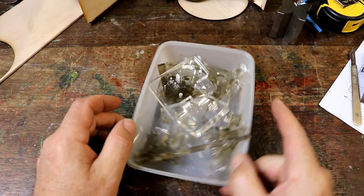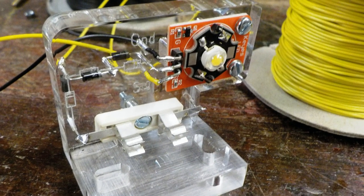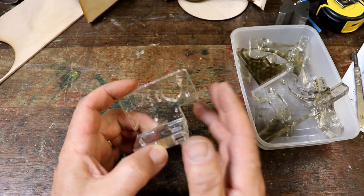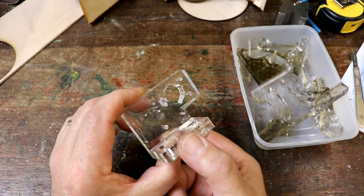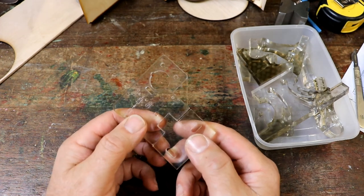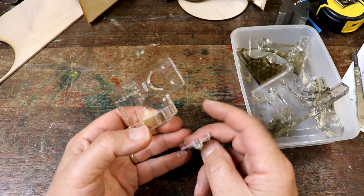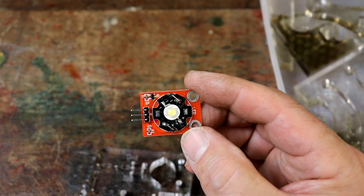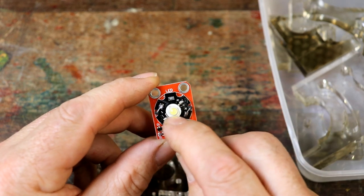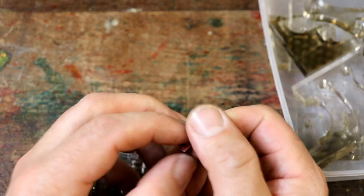Here are all the 10mm parts — all sorts of exciting things. I'll run through them very briefly. This thing supports the LED lamp that illuminates the scenes. I always get a bit paranoid about having a high power three watt LED in a small enclosed space, so I decided to take some action. First thing was to build this huge support for the LED with a finger joint so it can be glued really firmly — it's such a joy the way that fits together. The LED I used was one of these — I think they're called KYS. This was a three watt warm white and it comes on a printed circuit board that's got heat sink parts to it, a very small transistor, and a couple of resistors.